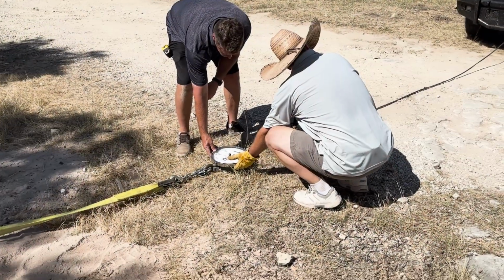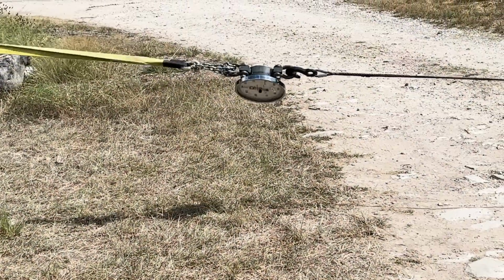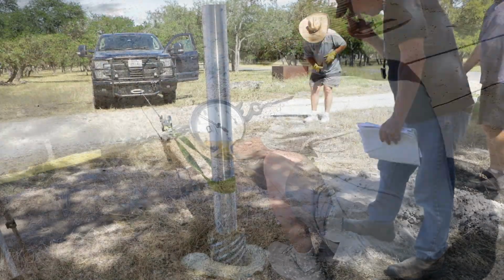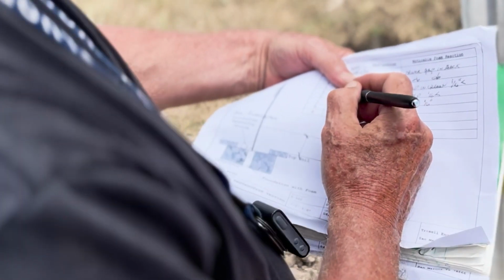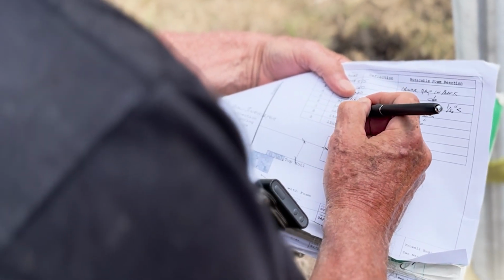A dynamometer was then attached between the flagpole shaft. Lateral pressure of 1,800 pounds of continuous tension was applied. In addition, repeated pressure and release motions were also applied for deflection testing. Each testing scenario was carefully monitored and documented by our structural engineer, Troxel Engineering.